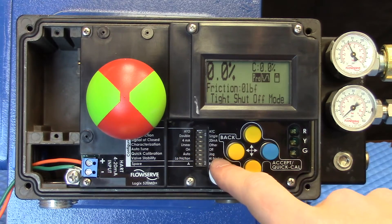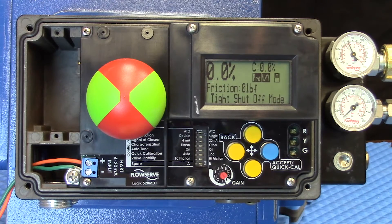Low friction versus high friction — this will take care of some issues with sticky packing where a valve will basically jerk and move around because of the high friction being fought against. Once the valve gets to a position relatively close to the signal, the positioner will then turn into a pressure controller and hold the valve in position until a larger command signal change has been sent to the valve.